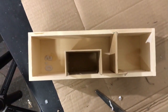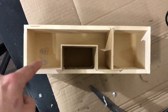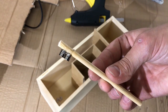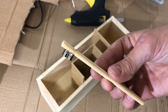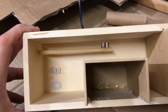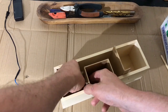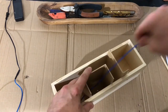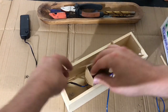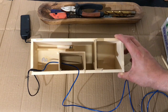You can now see my intentions for the shape of the lamp, with the bottom section being thicker than the upper section. I wanted the lamp to have a hidden magnet inside, so I stuck the neodymium magnets to the wooden rod and glued it to the bottom of the mould, making sure it wasn't touching any edges. I threaded the EL wire through the hole I created earlier. There we go. Then it was time to get messy with the cement.